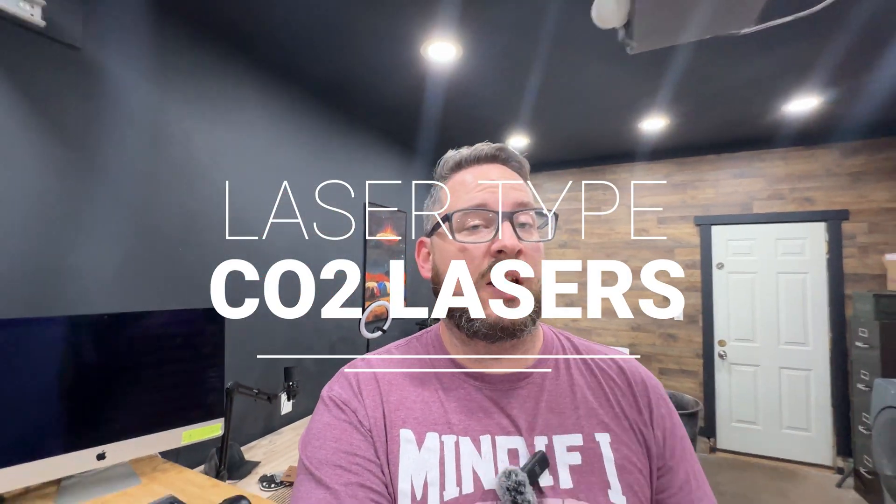Jumping into CO2 lasers — there are a couple things to consider, and the first is price. You can get smaller desktop CO2 lasers for around $1,500, but they go up from there. The one behind me is a 60-watt CO2 laser from Omtech — the whole setup costs around $4,000. You need to know that unless you get a brand like Aeon or Thunder that has built-in chillers and accessories, you're going to need a chiller and you'll likely want to upgrade the air assist with a small air compressor. There are additional costs, especially if you go with Omtech.